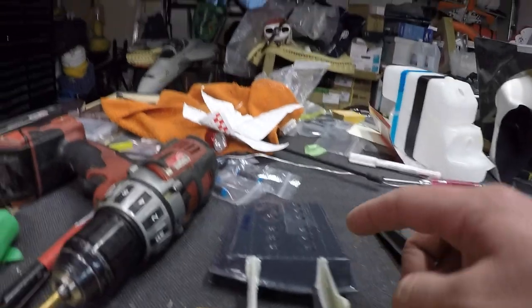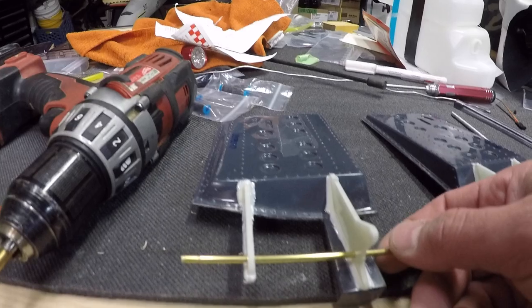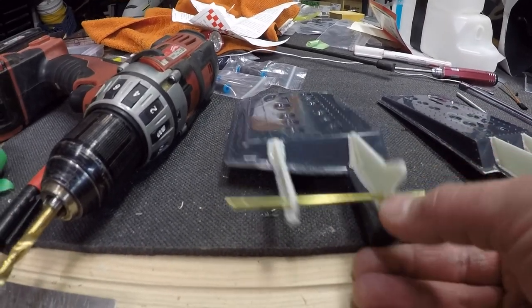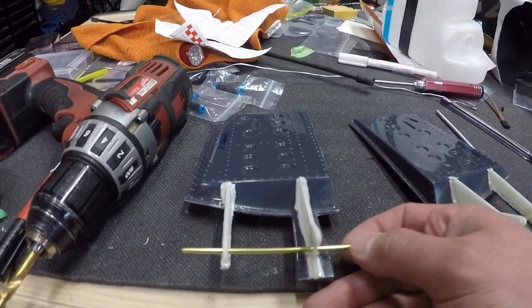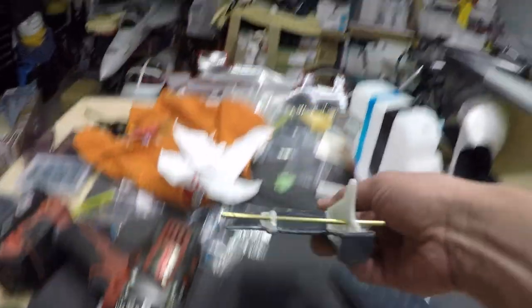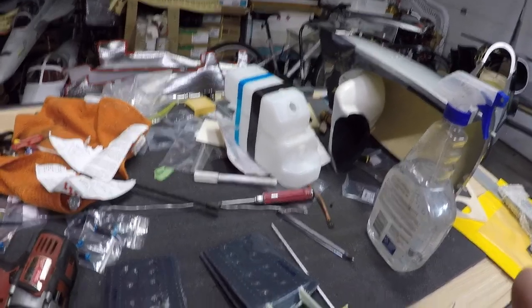What I did was get that all hysol'd up, put the pieces in place, have the pivot going through, and just use small clamps to hold those in place — they're awesome. The hole lines up perfectly and everything looks really good. So that's glued. Next step is going to be to flip the airframe over, work on getting these things positioned, getting the holes the right size, and finishing up the speed brake.